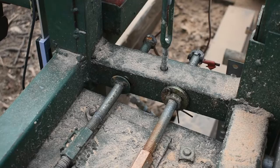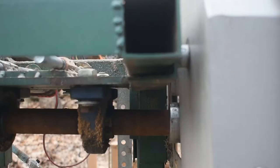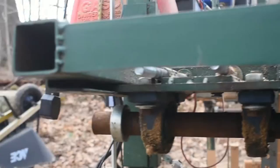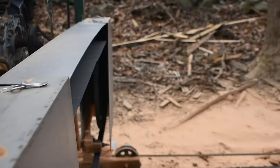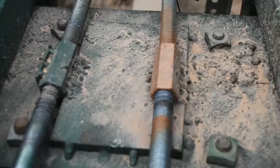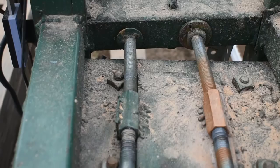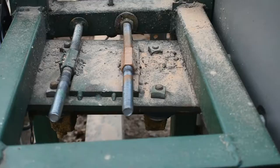For tensioning, there are multiple ways to do it — some guys use a hydraulic jack. I have two all-thread bolts here that allow this plate to move in a gap. The plate can pivot forward and backwards, which sets tension on the blade and also sets the angle of this wheel in or out — that's your tracking. I use a torque wrench to tighten the outer one to set tension. You don't want to leave the blade tensioned up — it's tough on the components — so de-tension when you're done cutting for the day.